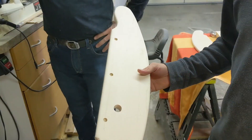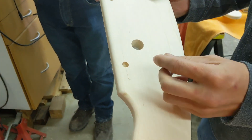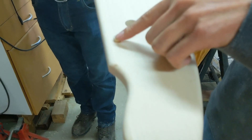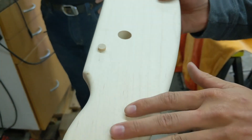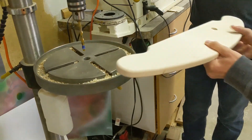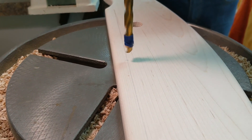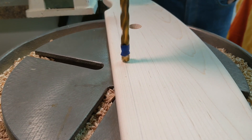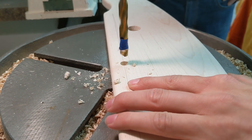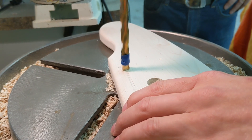What we're doing right now is we've got a 3/8 drill bit and we're going to go probably a quarter inch into here so we can put these nice little plugs — basically put a screw in there and then put this plug over the top of it, nice and flush. Just cleans it up a little bit. Just mark these, use a punch, then mark our drill bit for the depth. Pretty straightforward.